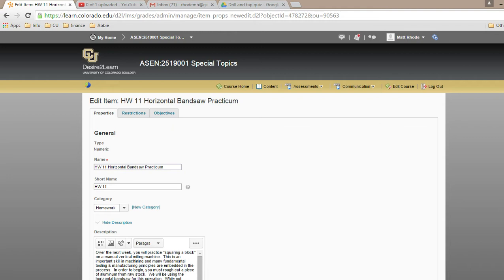Did you explain that yet, or is that it? I have not. I'll do that when we talk about the milling machine on, I believe, Thursday. Okay, so you'll be lectured on how to square a block. But the first step is to cut this to the raw dimension. We're going to give you 1-inch by 1-inch aluminum bar. If I want this other dimension to be 1-inch, would I bandsaw it right at 1-inch? No, I bandsaw it a little bit bigger, so that I can cut some off this side and cut some off this side and make it smooth and nice.